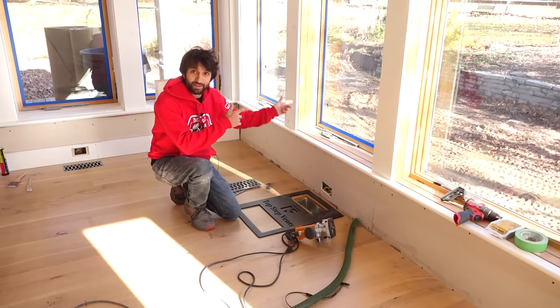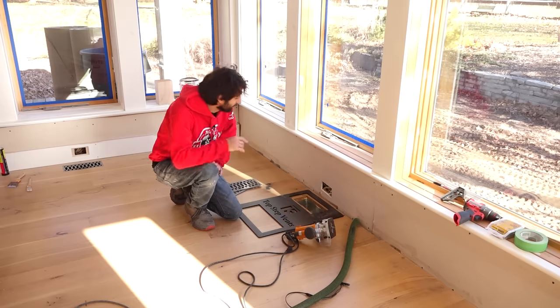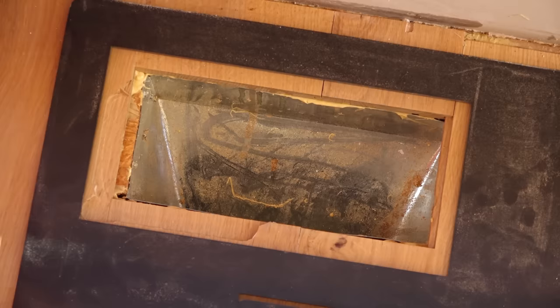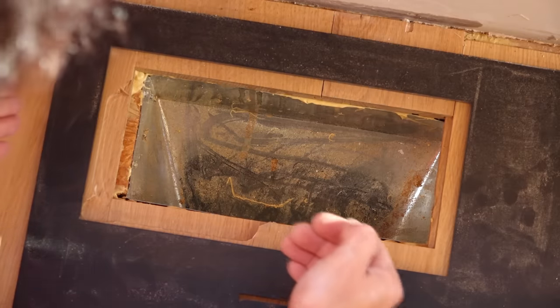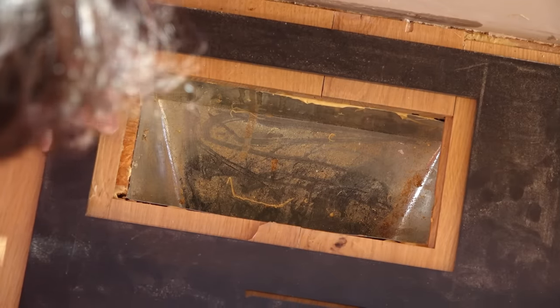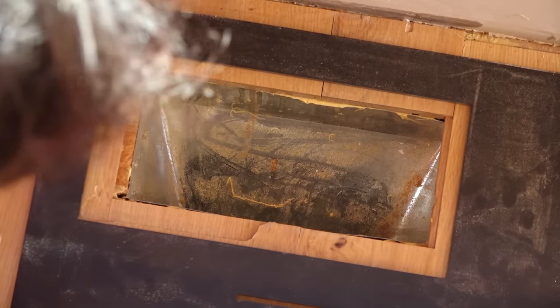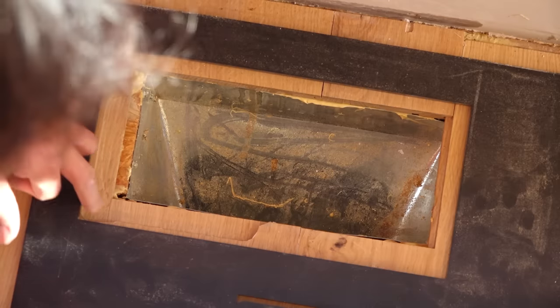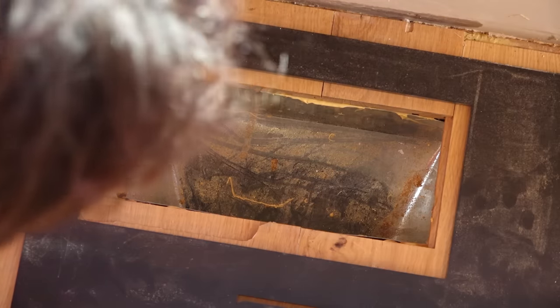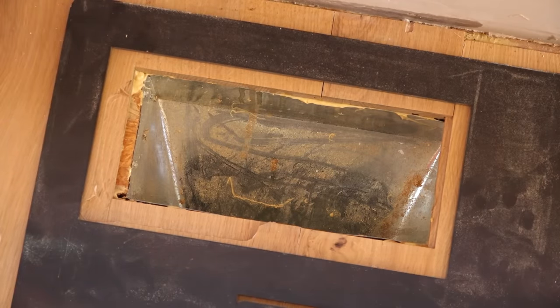Okay, so while the pieces are over in paint, I got my new bit. We're going to finish up the install of these vents and find some other stuff to do. Fortunately the fix on this is pretty easy because I only got to this one corner. The template is moved over this way and away from the wall a little bit. It used to be right over here. If I come this way to incorporate the cutout here that I erroneously made, now the vent's somewhere in there. So basically the vent is no longer centered between the two seams here. It's a little off-centered, it's 1/4 inch to the left, but I don't think that's going to matter a whole lot.